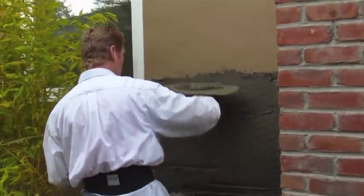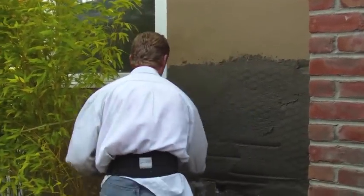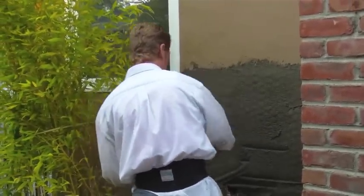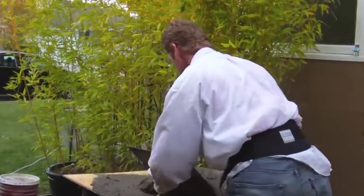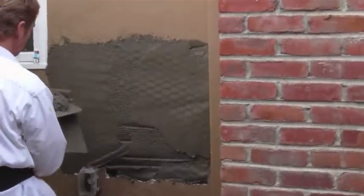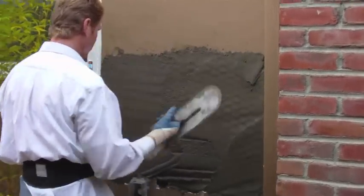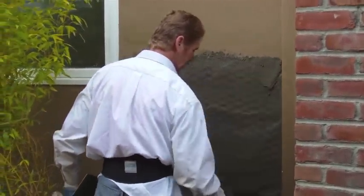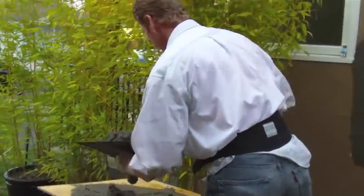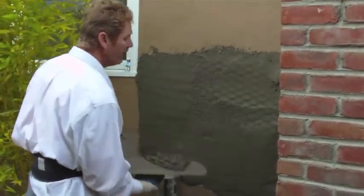They don't make a 5-minute mud, but I put accelerators in it to give it what I know to be 5 minutes. Again, Jason's been mixing for years, so he knows how to mix it just right. So if any of you guys try to do this, you say, like a lot of people do, man, I watched you do it, I dropped half of it. Or it came off because it was too soupy. It takes time to learn how to even mix this mud. And I'm not talking about a month. It takes years.